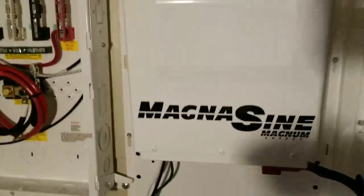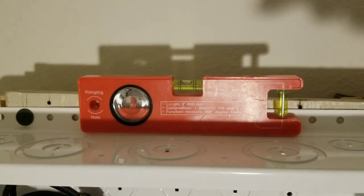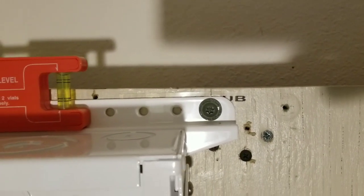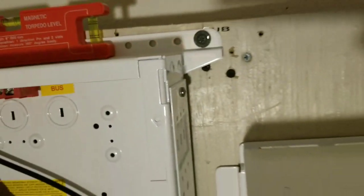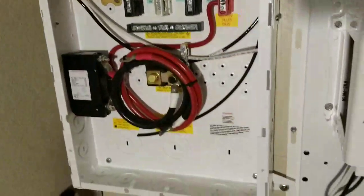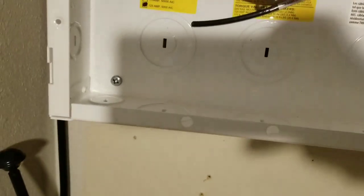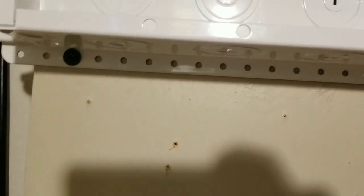I used two back plates — the long one for a single stack for two inverters. If it had been just a dual, it would be a shorter one, probably cutting right from the middle. Look at that — dead level, with a bubble right there. I used a security star bolt to get into all the wood, penetrating right into it so it holds it dead in place. There's a leg right here — follow it all the way up — and a mounting bracket to install and screw.